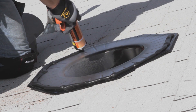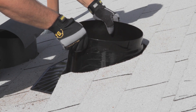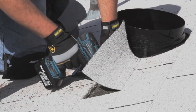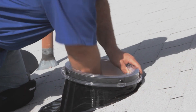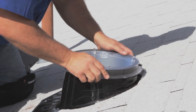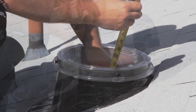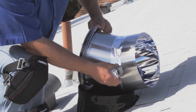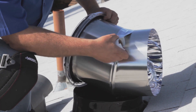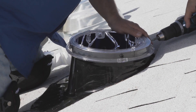Remove the flashing and apply sealant to the underside, then slide the flashing underneath the loose shingles. Do not smear the sealant when inserting the flashing. Secure the flashing to the roof using 8 flashing screws. Insert the top assembly into the flashing and, using your hand, rotate the tube until the tube angle aligns with the ceiling opening below. Measure the distance from the ceiling opening to the top tube to determine the length of the connecting extension tubes. Once the desired angle is set, remove the top assembly and secure the tube angle by taping the tube seam with foil tape. Reinsert the top assembly into the flashing, then fasten the dome ring using 4 dome ring screws.